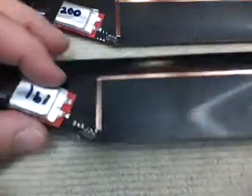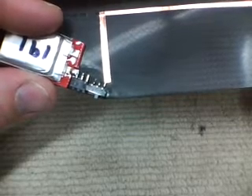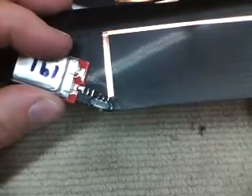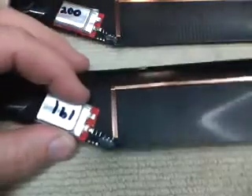If you look closely here, as I line that up, I'm going to bring that right up to that first pin on that three-pin SIP — that's going to be the negative side of that charge port. We'll put some jumpers in to carry the rest of it over to the switch and carry the positive in. That one's a critical piece to get lined up right. You can see right there, I just slipped it right underneath that pin. Here's a small boo-boo: I was trimming off the edge of some of the tape and put a hole in the edge of the lipo with the scissors. So always keep a spare around.